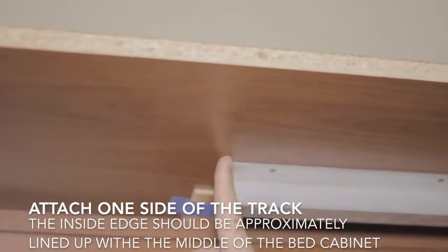You then put the roller posts through the hole and secure them from below with the plates, simply screwing those in place. The new rollers are easily adjustable from below once assembled, so you don't have to worry too much about them being screwed in the same amount — just make sure they are at least all the way through the steel plate that they're screwed into, but not too much beyond that.